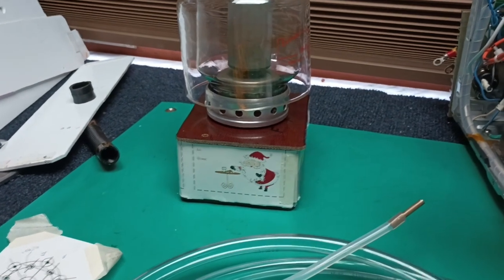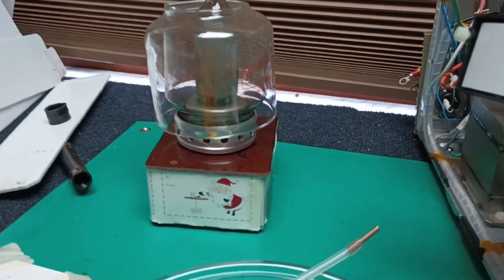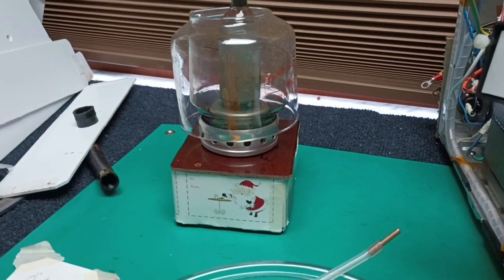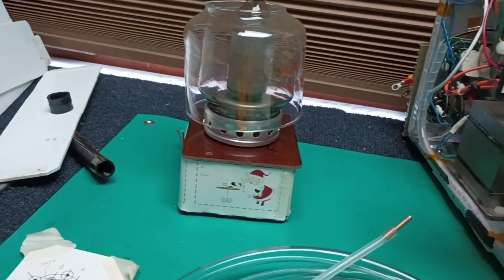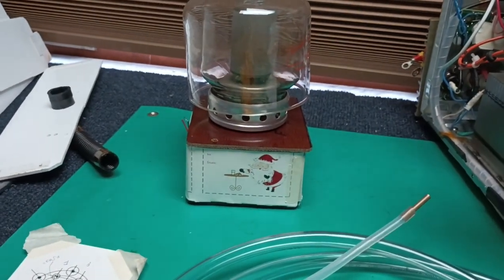So arrange your pressure measuring locations away from points with high voltage. That should be obvious. But make sure you can't accidentally move a hand around and brush it against that plate terminal, because they might be throwing dirt over you next week. These tubes are very dangerous in operation. So careful. There's no such thing as dead viewers.